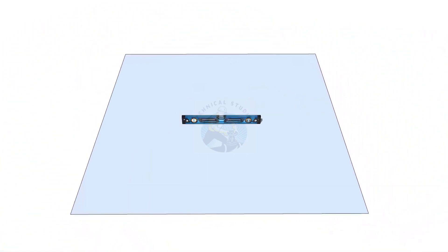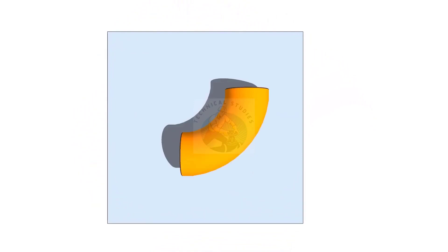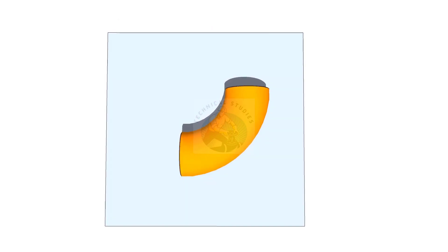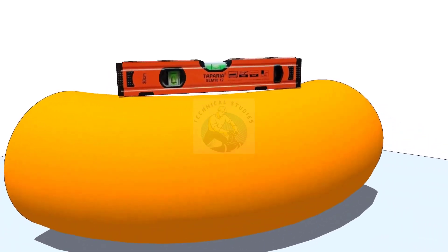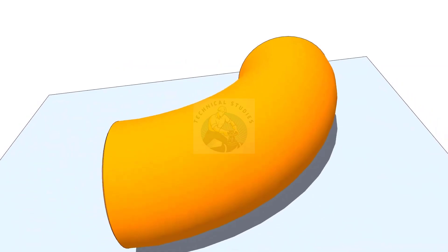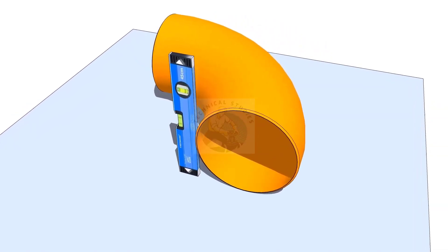For the demonstration, I will show you how to fit up the elbow 45 degree rotated. Choose a leveled plate or a platform. Put the elbow on the plate and make it level. Hold a level bottle at its side vertically and firmly.